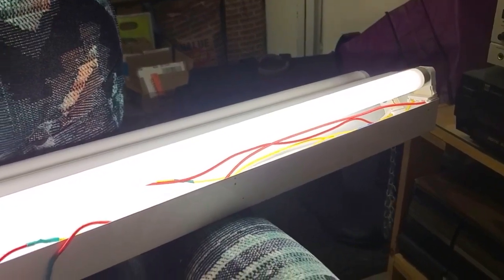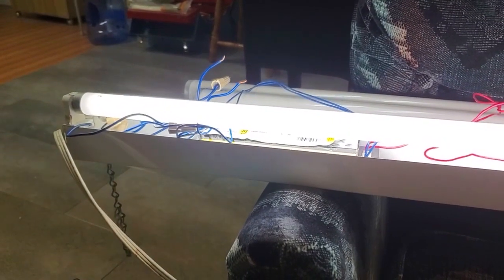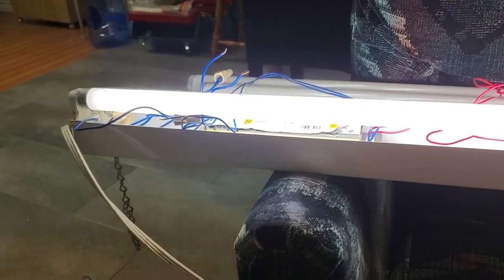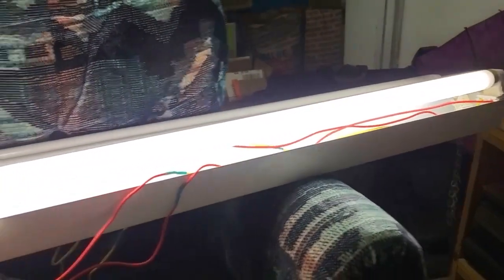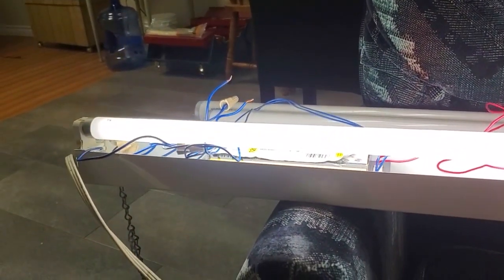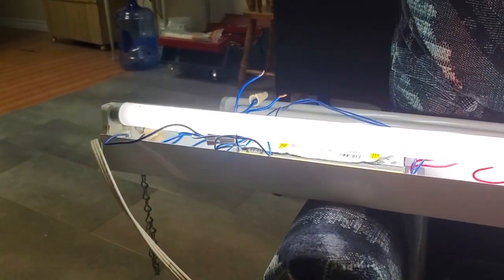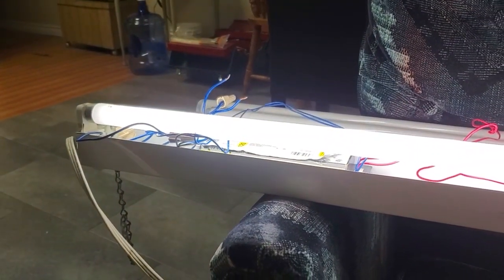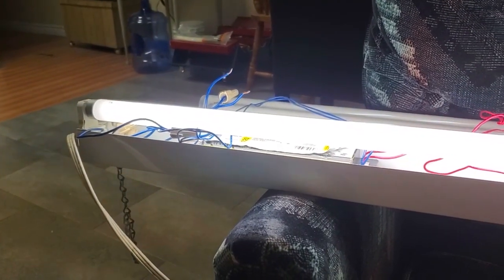What I'm gathering here is that the cathodes are heated from a single constant current source. So if one cathode goes open and there's only one being connected, that one connected cathode is going to get double the current than if both cathodes are working. That is an odd design - not an optimal design in my opinion. Very strange. I don't know if that's a design deficiency or just a consequence of the sort of old design of this ballast.